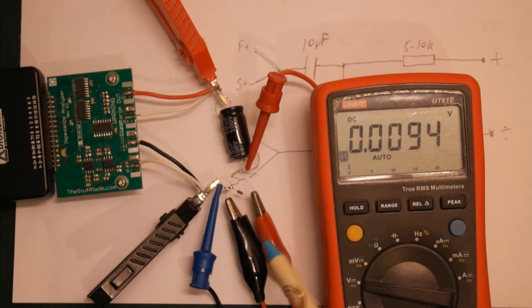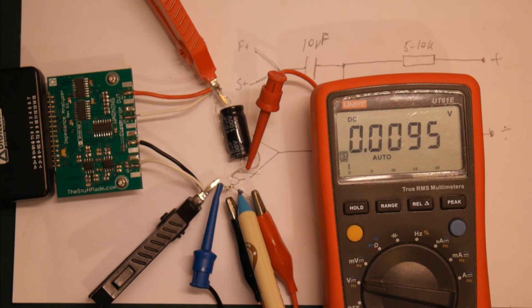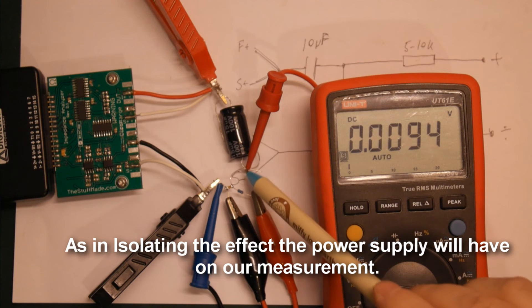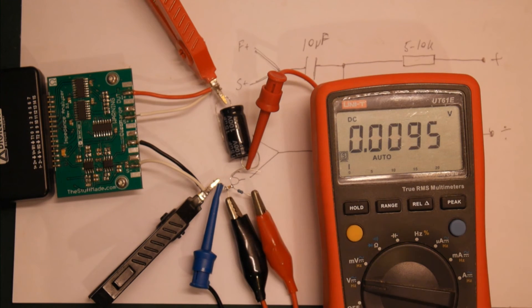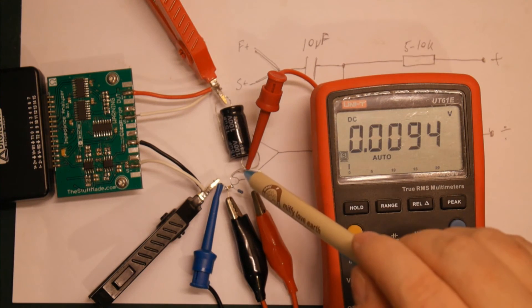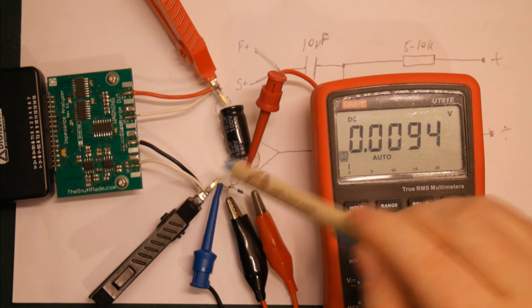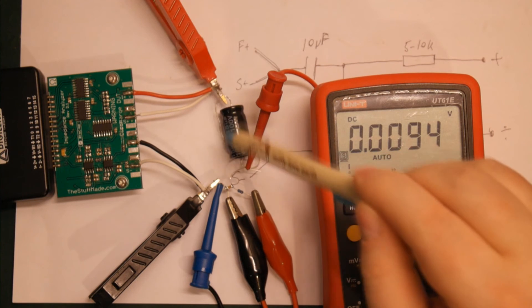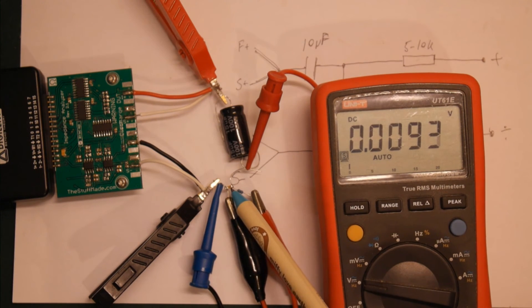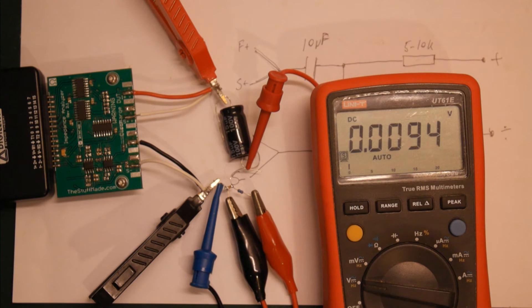It's all hooked up. These two wires go over to my power supply, plus and minus, and then we have our little 10 kilohm resistor for current limiting and isolating the power supply. I also hooked up a multimeter so we can see the actual voltage across the capacitor. One thing worth mentioning is calibration: I've done open-short calibration. Open means nothing connected; for the short calibration, we include the DC blocking capacitor, so it gets calibrated out in the final measurements.